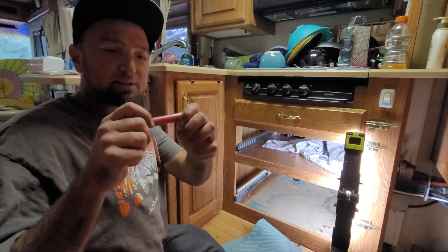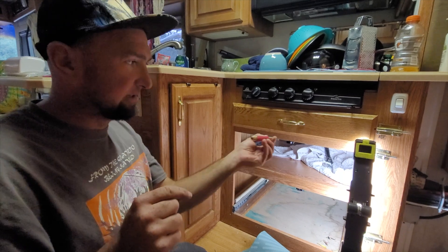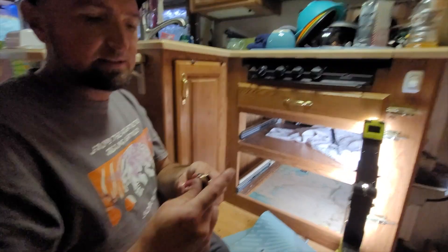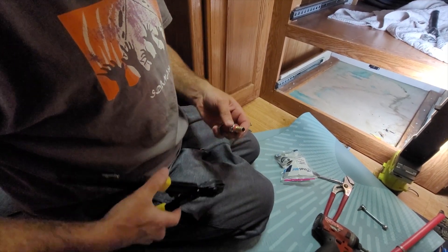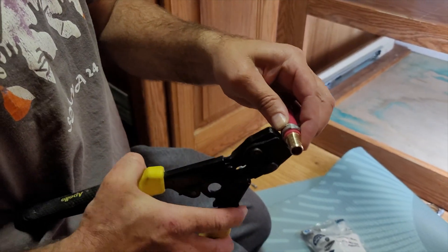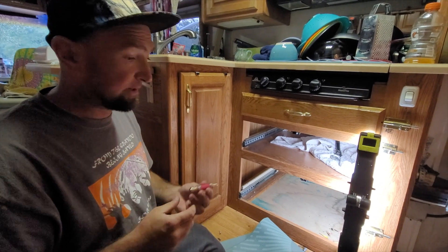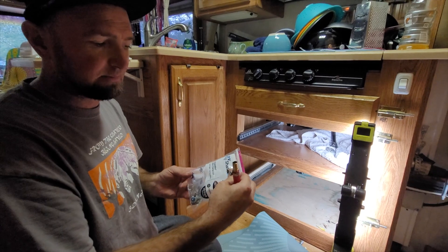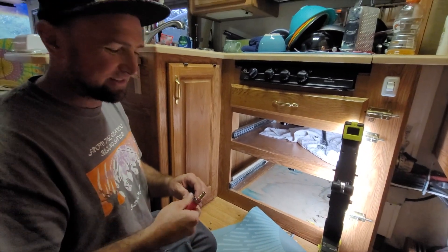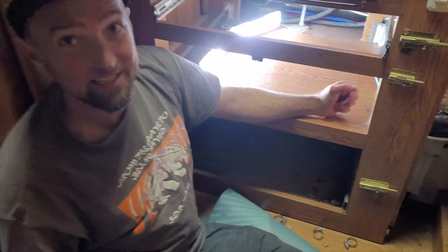All right, so I've got my piece of PEX hose here — my water line even matches red for hot water. I cut it to fit in there. It's going to be easier to crimp these two out here. I've got my crimping tool here. I'll take that and put it in like so. Now that's locked in, and I'll slide on my other two SharkBite PEX clamp half-inch crimp bands on either side of the line, put this in, clamp it down. So we did it — got that splice in there, everything worked out well. Just had to take out the top drawer to get my tool in there. She's repaired — I'll turn it on and check for leaks in a moment.